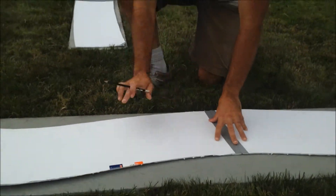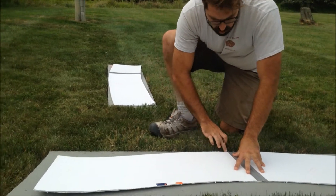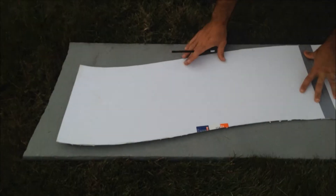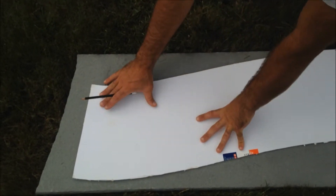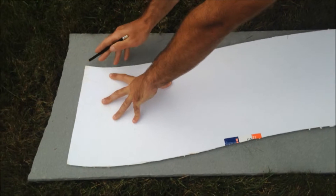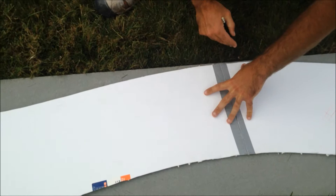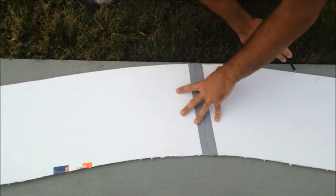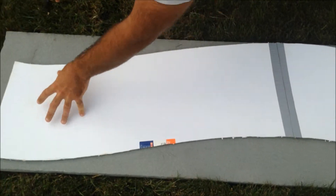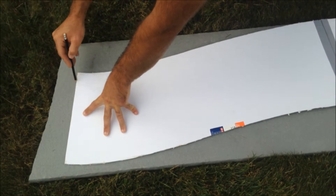What you want to do is make sure that your template is fitting everywhere on your stone and you have plenty of overhang. You do not want it ever to go to the edge because that makes cutting it a little bit more difficult when it goes right off the edge. What you will do is place it right here, make sure it is all level, and then without really moving the template too much you will just go right around and mark the stone. You want to make sure the template does not move while marking, otherwise your shape will be off.